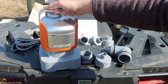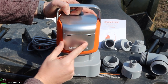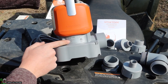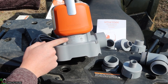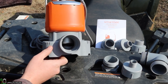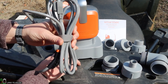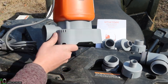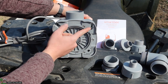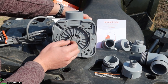Let's take a closer look at the pump itself. On the front it has two different LED spots that will either be red or green based on the function. It says SmartBot, and on the back it has some information: 25 foot max lift height, 120 volts at 3.2 amps. The two inch opening is where your water comes out. It also has a nice long cord with a piece of velcro to hold it together. Spinning it up underneath, it has the place where it reads the water level — very low, about a quarter inch — and a nice grate over the impeller so it won't suck up anything too big.